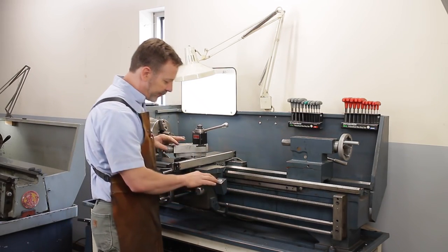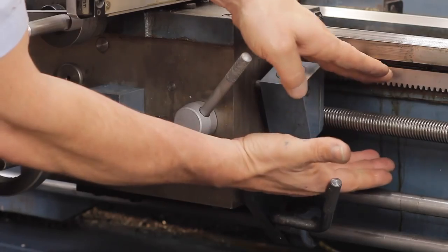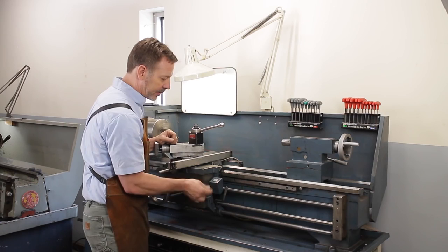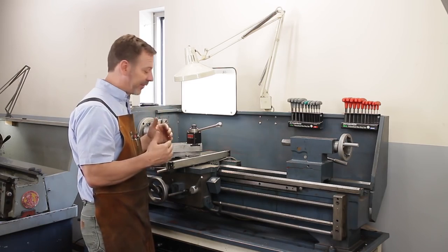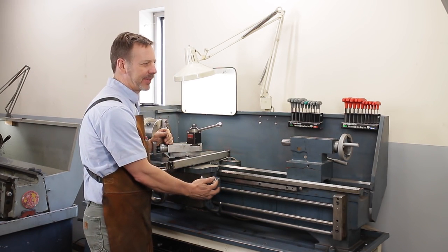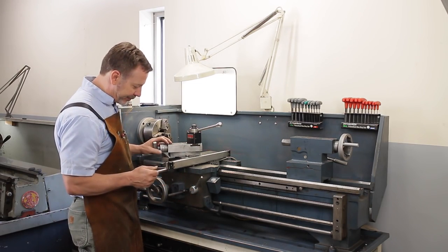Next, you'll want to try the different ways of activating the transmission. This one here is a lock nut. What it does, it's a half nut that clamps onto the lead screw. Turn the lathe on and just try it. See how it fits. This one here is, of course, in excellent shape. This also has a threading dial. That's not a deal breaker, but I wouldn't buy a lathe that doesn't have one, except I did buy a lathe that didn't have one, the Hardinge, and it doesn't have one. So, like I say, this is different on all lathes.